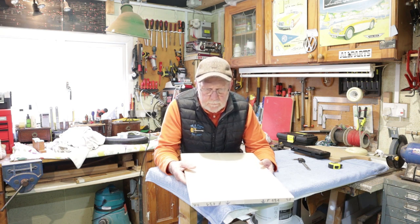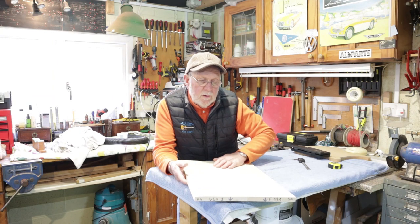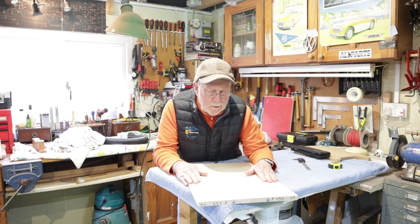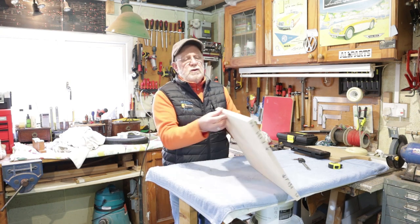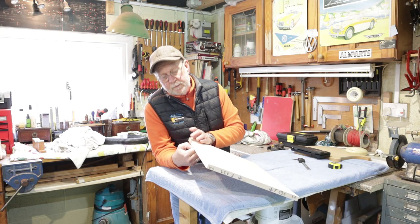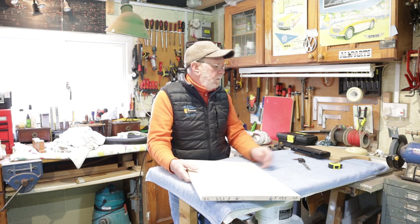Anyway, back to the sander. The sanding disc can be expensive. This has been sanded out to 80 grit, just to get it nice and flat, so I can glue this now to the mahogany back and see how it goes. It's not going to be a deep carve. I'll leave a 6mm binding if I can, possibly 5mm.